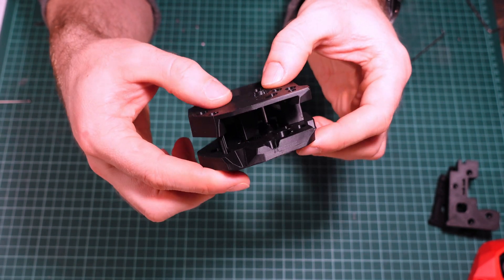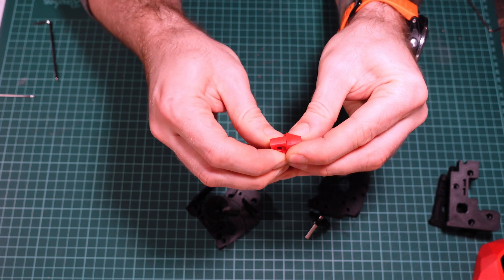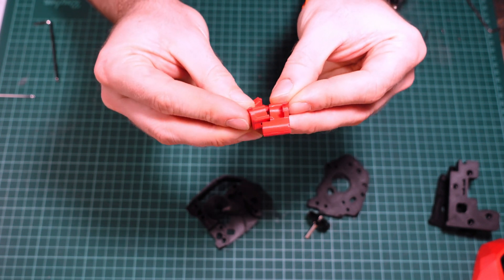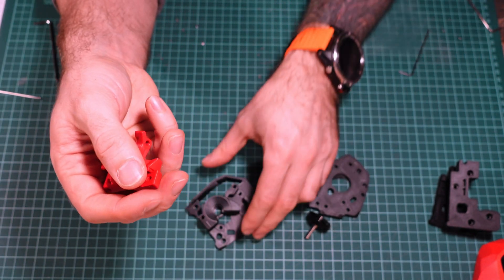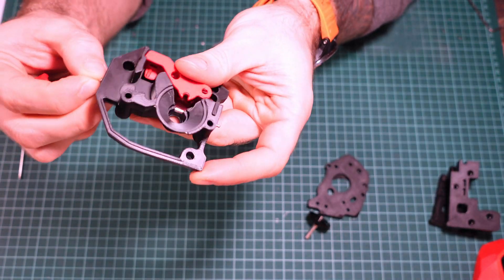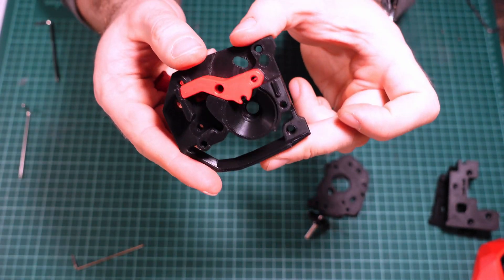The main drive gear comes in here. This is a very tight build which will contribute to the rigidity and stability of the extruder. All the smaller parts are also redone. The two-gear lever now consists of two parts, and instead of just pushing the two gear in, you clip it in. If we push something into the filament hole, you can see how tight this actually is — there is a very small distance between the filament and the gears, much more compact than the original Clockwork.